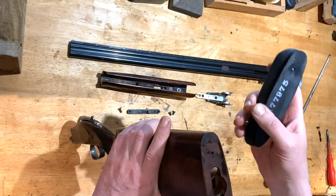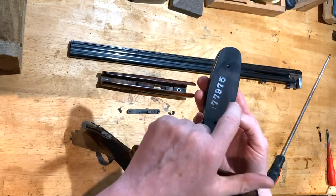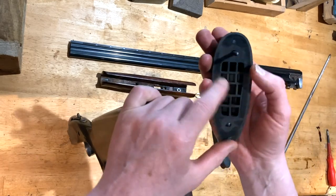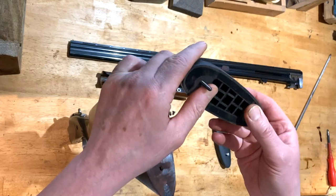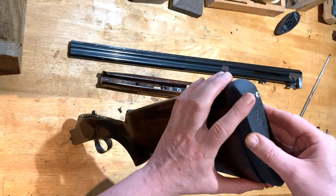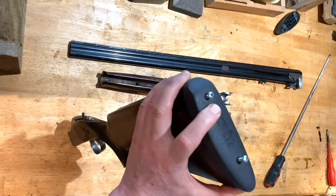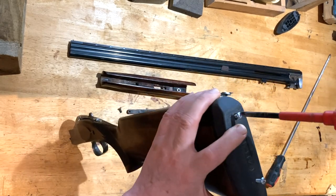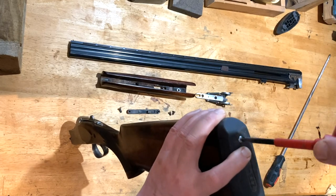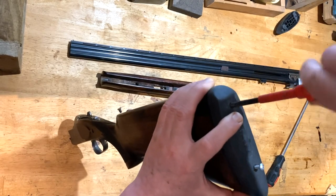Highly recommend the Kick Easy. You get them from all good gunsmith shops and stores. They have a very solid backplate, as opposed to your Berettas and the like, where you have this hollow thing, so when they screw that down, it tends to flex and cause you all kinds of problems. This is a nice solid one. Your local gunsmith will happily grind that to fit your gun. And they have these self-healing holes, so in this case it's a posi drive. Sometimes the friction can grip the screwdriver and actually make it harder to screw in the actual screw. That's acceptable and normal.